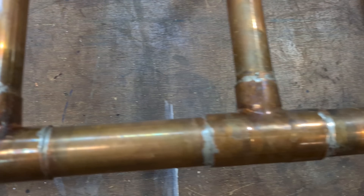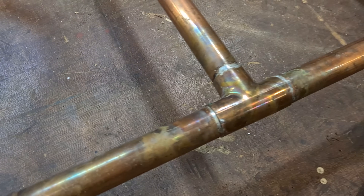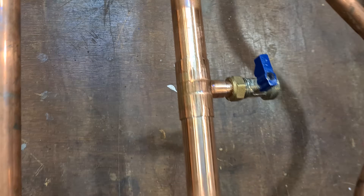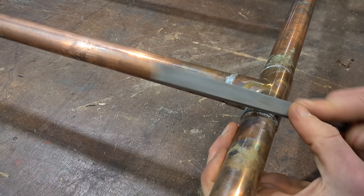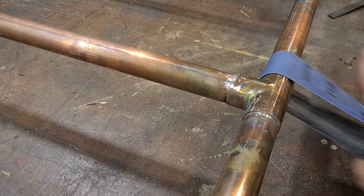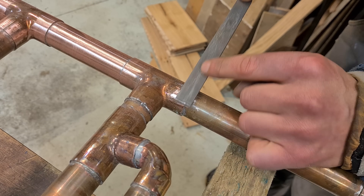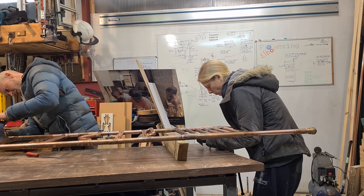Most of these joints aren't sort of terrible as far as solder joints go. They're certainly not pretty — not like that sort of joint. So here's how we tidy them up. Where I was a bit overzealous with adding the solder and there's big dollops of it, they get a bit of filing down and that's quite quick. Luckily there's not too much of that, and everything else gets fine emery paper, starting with 120 and then working up to the higher finer grits.